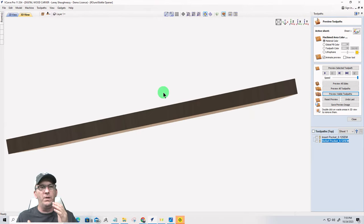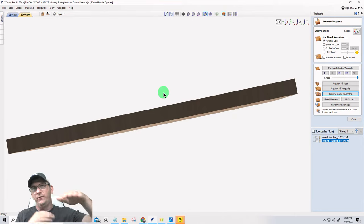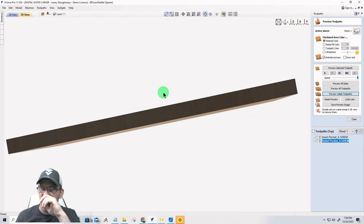You've got to think about, all right, do I want to run this through a planer? Am I going to surface it down on the waste board? Because I'm going to go to the lumber yard and buy a 3/4 inch board. If I go to a rough lumber yard, like a sawmill type yard, it's most likely going to be S4, finished on four sides, or S1, and then I'll have to do all the milling work. But if I go to Lowe's or a big box store for oak or select pine, that's going to be 3/4. You can either go the full 3/4 if you don't feel it's too bulky. If you feel it's too bulky, then half inch, shave a quarter off, okay? Sound good? Sound good.